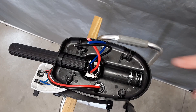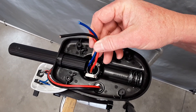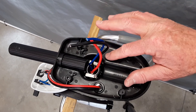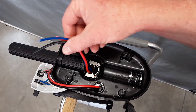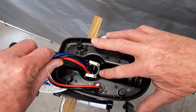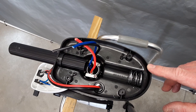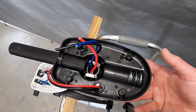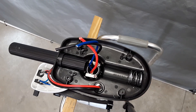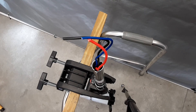What I was able to do was move these metal spring-like flaps out of the way, then position the three wires coming out of the shaft through the center of the shaft, and push the flaps out of the way so the wire will move freely. And if you look down inside, you're going to see that horizontal bolt that runs through the base of the control box, and that attaches this to the shaft. So I'm going to remove that bolt and the whole remainder of the control box base will pop off. The box has been removed and all you have is the three wires coming out of the shaft.